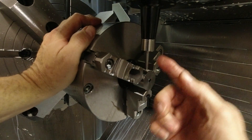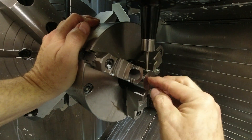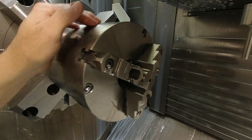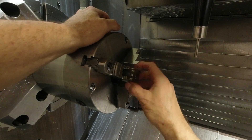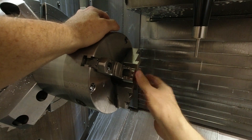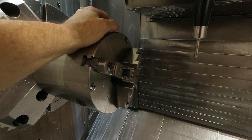Now that's lined up with my Y zero — Y is this way on this machine. I jog the tool up out of the way and out of the part. Now I'm lined up and I push the part back against the parallel so I can skim the face with the turning tool and mill my slot. It will rotate 90 degrees and I can mill the slot in the face of the part.